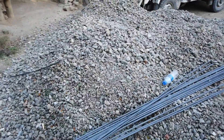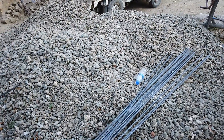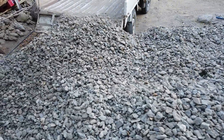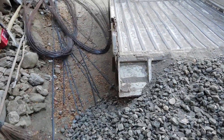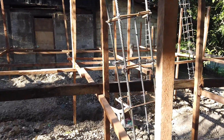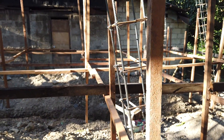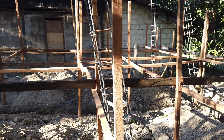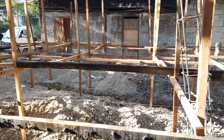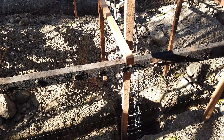Out of the eight columns with four 10mm rebars each, there are about 20 stirrups per column. The rings you can see around the columns are stirrups made from 8mm rebar. The stirrups function simply to hold the rebars together. This is a bungalow built on flatland with solid ground — the ground here is quite hard.